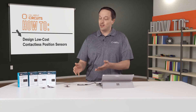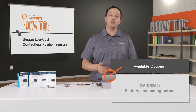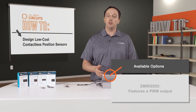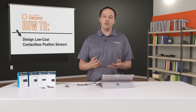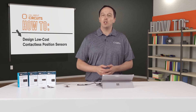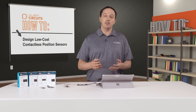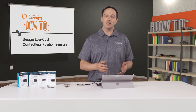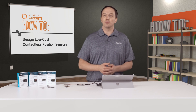This is a ZMID 5203, which has a SENT interface, but there is also the ZMID 5201 with an analog output, and the ZMID 5202 with a PWM output. All variants use the output pin as a one-wire interface for programming and reading on-chip registers. With the ZMID 5200 family, you have all the freedom to design the coils depending on your application, be it on-axis or end of shaft, off-axis or side shaft, short or long linear strokes, and small or large angles up to 360 degrees, and you always get the full resolution at any angle range.